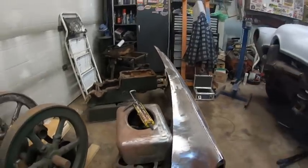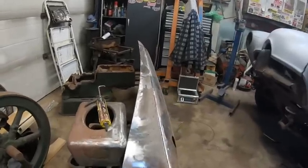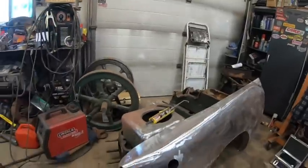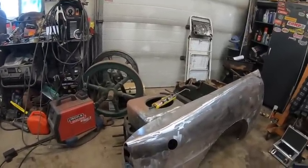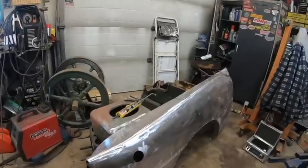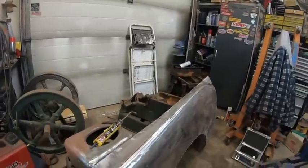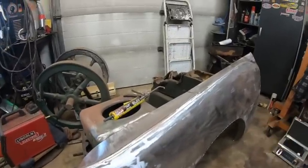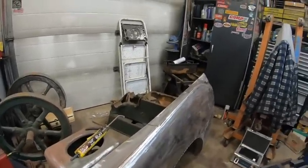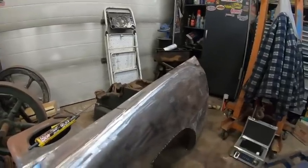I didn't film any of this, but all of this was all green paint. That's all taken care of. Backside, I scrimmed off all the surface rust, so I just finished that. I'll wipe it down, degrease it, and shoot it in the sealer because there were already a few little rust spots from sitting for a few days. So we'll do that today and put it on so it's out of the way. But yes, like I said, I've got a million hours left of welding and grinding and finishing and then mudding and whatnot. But yeah, I'm pretty happy with the way it all turned out.